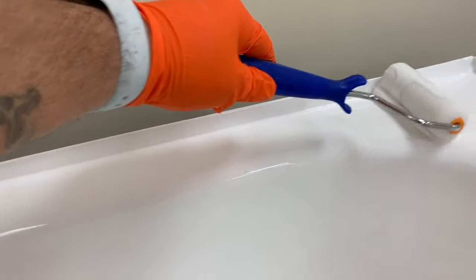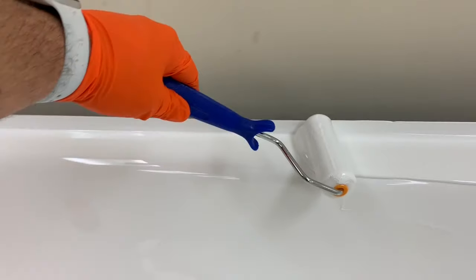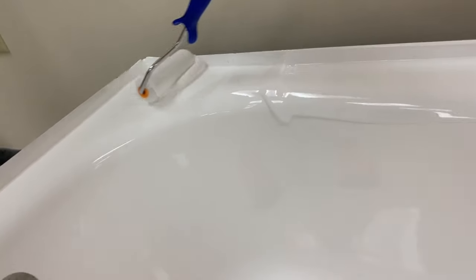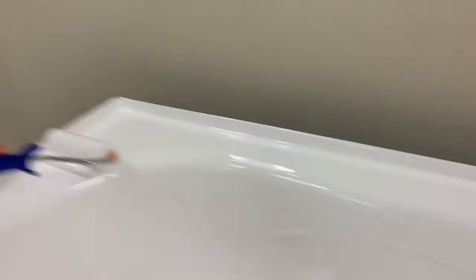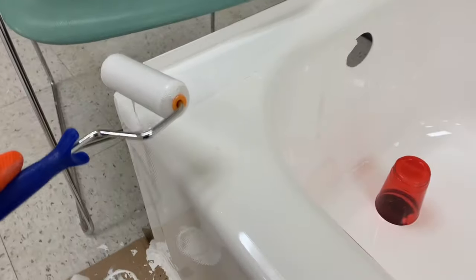As you can see, it's smooth because we poured it very fast and full. Now you take the foam roller with medium pressure - see that wave that's built up there? It pushes all that extra material down. You want to angle it into the corner and pull the extra out. That pulls that entire wave of extra material out of there. Just do that once or twice - medium pressure is all you need - it just moves all this extra material down the wall so that you don't get drips later that you can't fix.